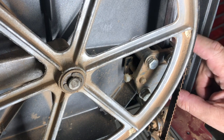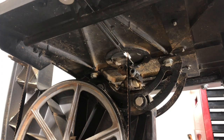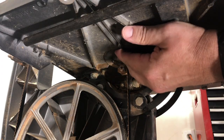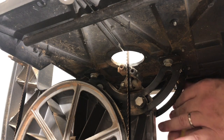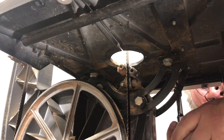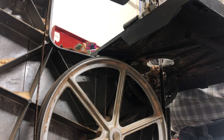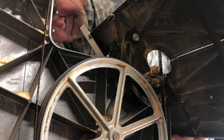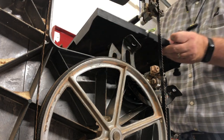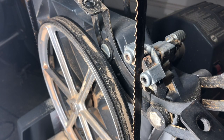This entire casting is held in place by two bolts that bolt to the back of the saw. To best see this, we're going to remove the table by removing the four bolts that hold it onto the trunnions — something you should never, ever have to do with your bandsaw normally. To get to the back bolts, we rotate the table using the table tilt adjustment. As always, everything is harder than it needs to be.